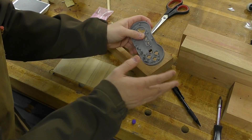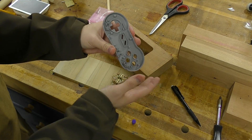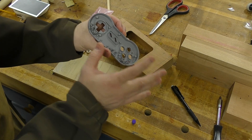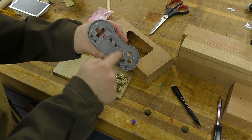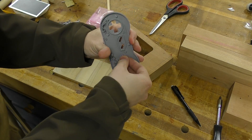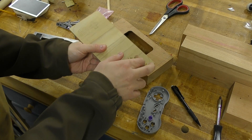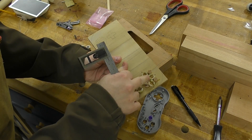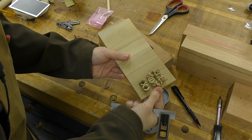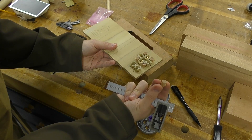When it came time to figure out how to mount these buttons into wood, I had some challenges because it's not like plastic where you can just mold a template. So I copied the existing controller's idea — a plastic housing with slits and buttons with little wings that stay inside the groove. I came up with something similar: a 5/8-inch dowel rod glued into the surface, drilled all the way through with a 3/8-inch drill bit, using 3/8-inch dowel rods as the buttons.